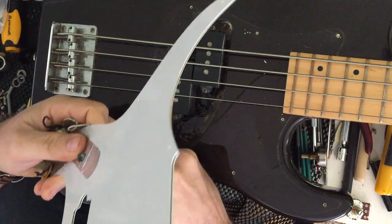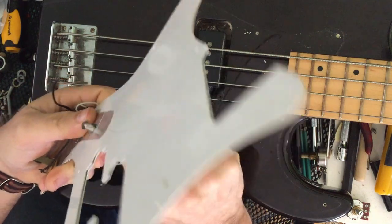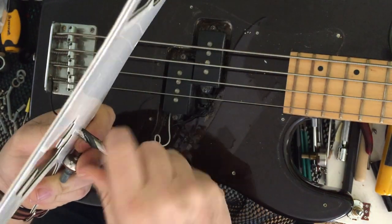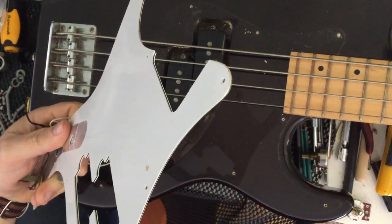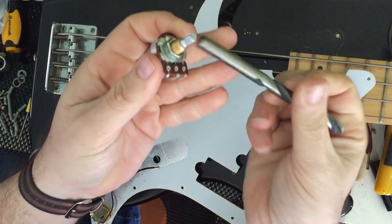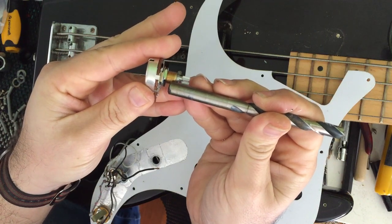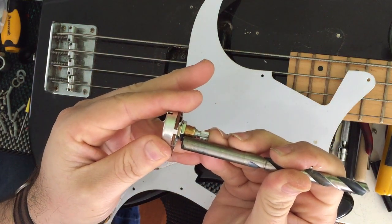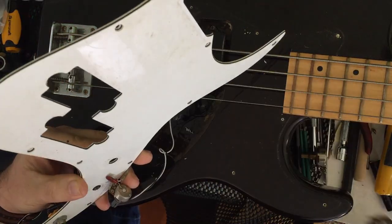What I'm going to do is just, with a drill bit, by hand, I've gone up in size by one mil, and I just scrape away at it like that. I'm going to vacuum all this up. Then I go up another size — that was 8.5 mil. How do you check what size drill bit you need? You get your bit and hold it up against the thread of the pot, and if you can no longer see the thread poking out behind the drill bit, then you're pretty much bang on. That one I can just see — that's a 9 mil.